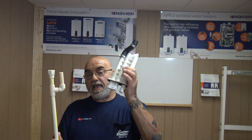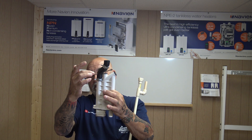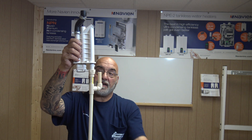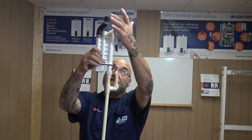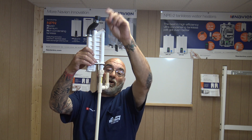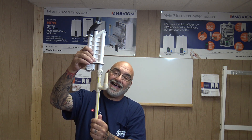This is an NPE, whether it's their smallest to the biggest — 160 to 240 — this is what you have. You have a rubber tube that goes down into this trap, comes up, and once it's filled, comes down into the female adapter at the bottom. This sits inside, three screws hold it, nice rubber gasket. That is the trap. This here goes to the bottom of the heat exchanger — there's a clamp that you push up onto the stainless steel fitting. The heat exchanger goes into the rubber tube, and it's rubber and plastic because it will not erode from the condensate.